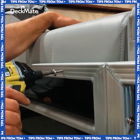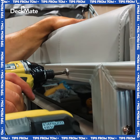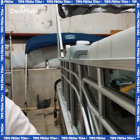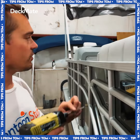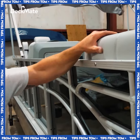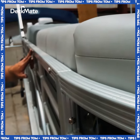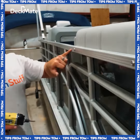I get it through my holes, I'm going to pull the seat back with some force, and then gently drive that in. Once I'm started, I'll go ahead and finish hand-tightening with a Phillips head screwdriver so I don't strip out that plastic. Feel it start to grab there — it pulls it nice and snug. Now my furniture lines up, I'm nice and secure, and on the outside of the railings I have a nice sharp look with this flat-head screw and finish washer.